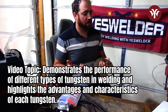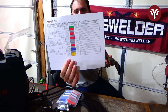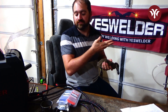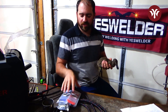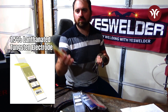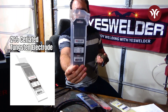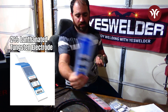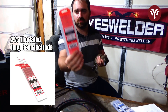Now I could just sit here and talk to you guys about which ones to use when according to this little chart that we have here. But instead of doing that, I figured it would be a good opportunity to just try them. So I'm going to try on a piece of stainless steel exhaust tubing. We have here 1.5% lanthanated, 2% ceriated, 2% lanthanated, and one of the most common ones, 2% thoriated.